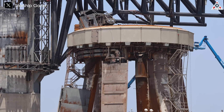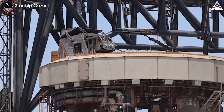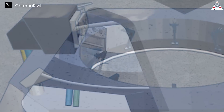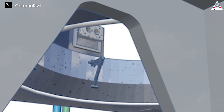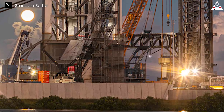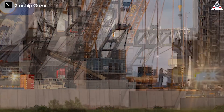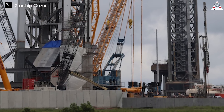If you're wondering about components like the piping of the booster quick disconnect system — how is that going to be designed to be mobile? The structure is expected to be more streamlined and simpler than traditional systems. One of the key improvements is in the booster's quick disconnect system. Instead of being directly attached to the OLM, the QD could be placed closer to the launch tower, allowing for a more flexible connection process. Workers have recently been installing pipes in this section — these might be removable connections known as umbilicals running from the ground equipment to the vehicle. These detachable lines will be mounted on a support stand, allowing easy repair or replacement if needed, while also protecting fixed ground equipment from potential explosions or damage.